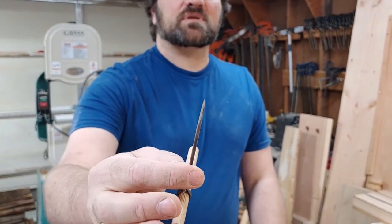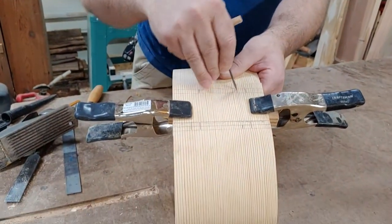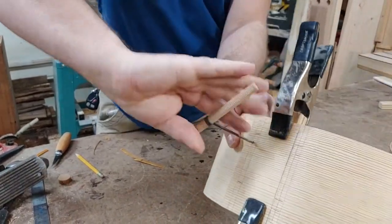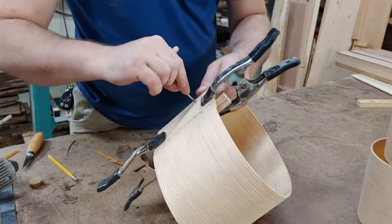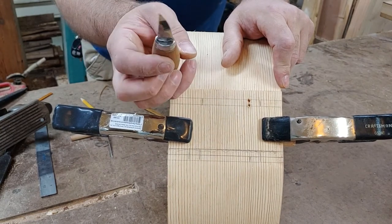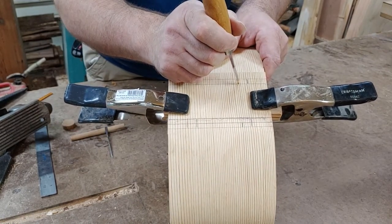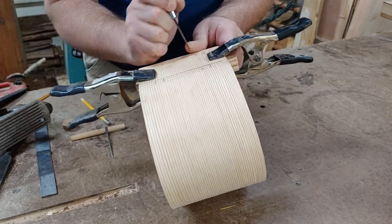This is a reproduction of a spoon bit or auger gimlet — they have different names depending on size. This is what I'll use to actually bore the hole. It's pretty simple: just put it there and rotate it back and forth as it slowly carves itself a hole. You can see it's making a hole — not all the way through yet. Keep going until voila, we're all the way through. So I've drilled both holes and now I'm going to take my knife — a nice fine-bladed little knife I got in Sweden. Basically I'm going to go back and forth taking little slivers out to connect both sides of the hole, a little bit at a time until it's completely free and I've got a slot going all the way across.